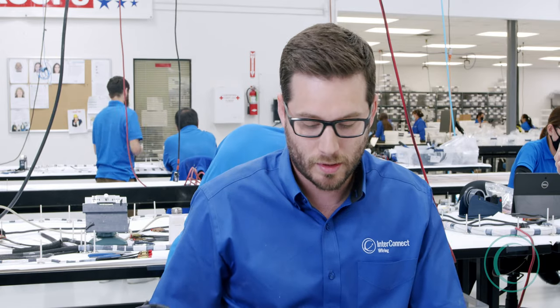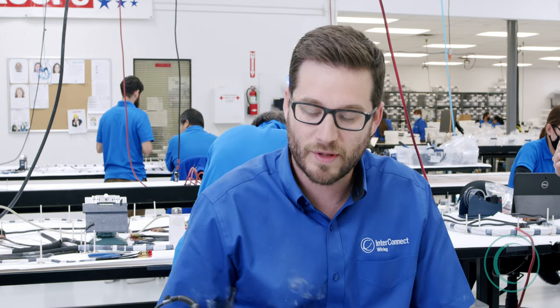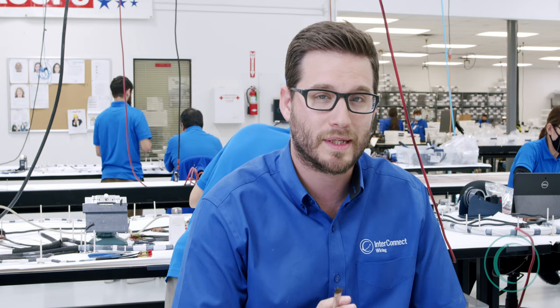Always allow for the solder to cool after you've completed your solder joint. There are a number of things you want to look for in a successful solder joint. You want to be sure there isn't any cold solder or disturbed solder — you'll see this by a different gray patchy area in the solder. You also want to be sure that you clean off all of the flux, as it is a corrosive material.